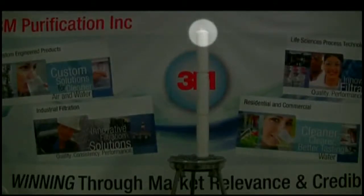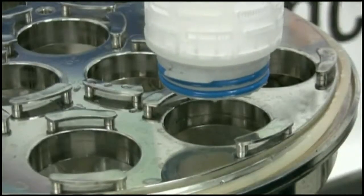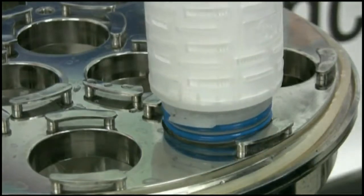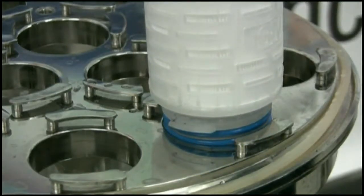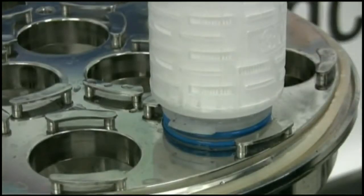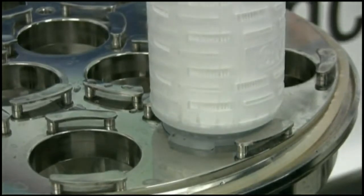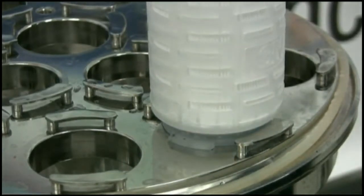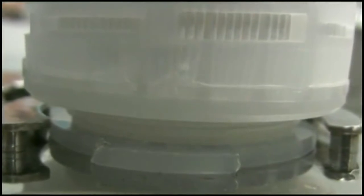Placing both hands atop the closed end of the filter, lower the filter into the open receptor. There will be immediate resistance when the filter contacts the receptor — this is normal and required for the filter to function properly. Exert downward force while maintaining the filter in the perpendicular position. As the open end descends into the receptor, a squeak from the O-rings may be audible and/or the installer may feel the filter drop into place. Regardless of whether you hear or feel anything, view the interface of the filter connector and housing base. If the O-rings are not clearly visible, the filter is completely lowered into the receptor.